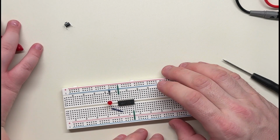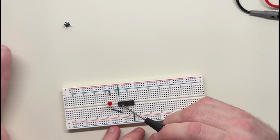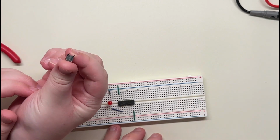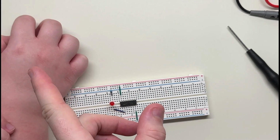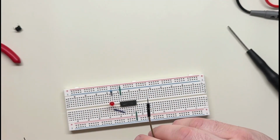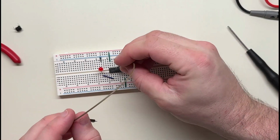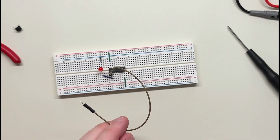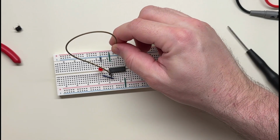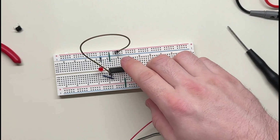Okay, now we have not fed any input into the other side of this gate here, so a button. I think let's get it to work first. Yeah, can you grab one of those long pinned, like this thing. Here we go, like this thing. I don't even know what this is called. Jumper, I guess. Long pin jumper, maybe. So what we'll do is we'll put this in here. This is the input to gate 1. And to start with, we will make it true. So we'll put it to plus. Now we need power. Now, what would happen if you set a true into an inverter?